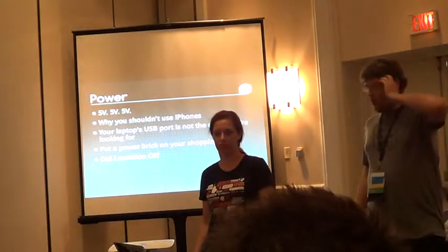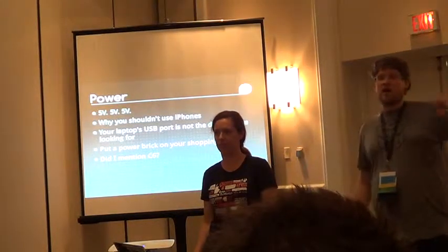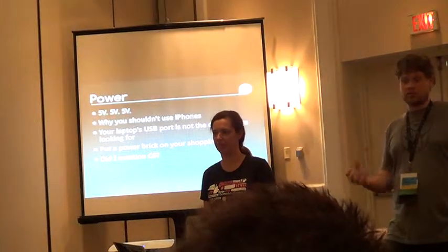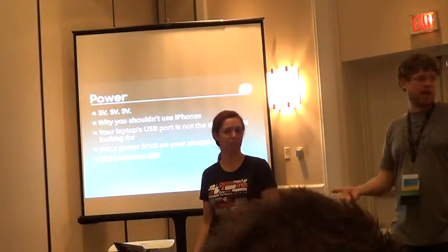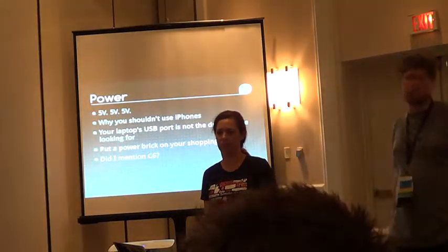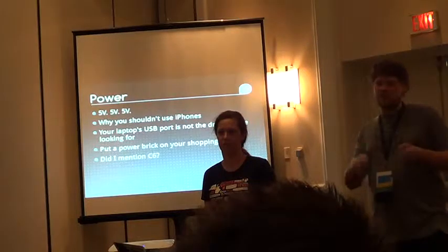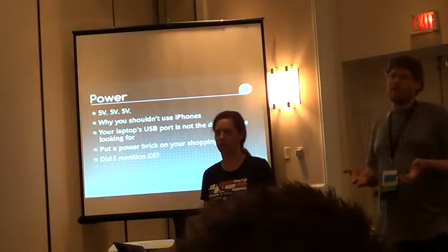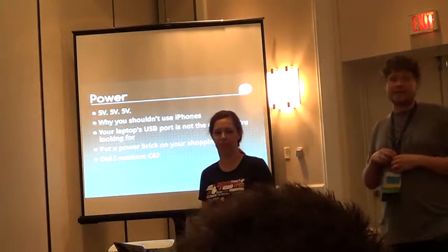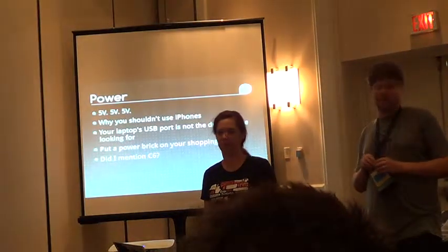So, what you probably want to do is you want to go out and get a nice high-grade, reliable, tested, proven 5-volt 1-amp, or a little more in each direction. Again, if you get a 1.1, it's going to be fine, or you go to a little bit less, you'll be fine. But it will save you a lot of heartburn later on in the process if you know you're starting with clean, regulated, tested power.